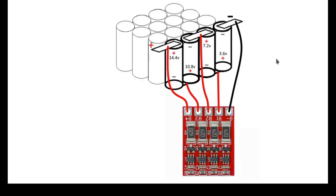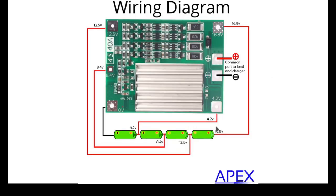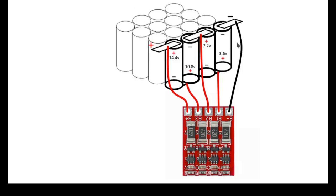You could put 18 volts into the battery and the BMS inside will keep it from overcharging. Once that battery is fully charged, the BMS will disconnect the battery from the input voltage. With a lead acid battery, it's not a computer inside the battery. You get the computer inside the lithium battery because it keeps you from fully discharging the cells and destroying the battery, or overcharging it and causing a hazard through short circuit. It also makes sure each bank is evenly charged.